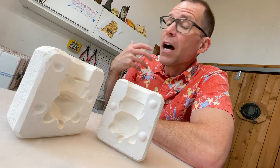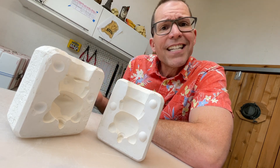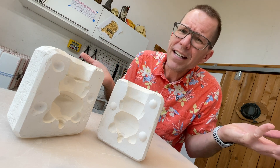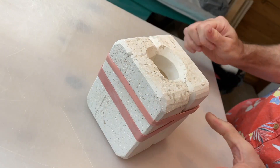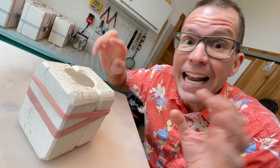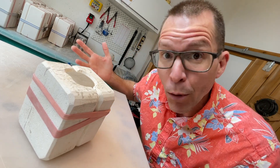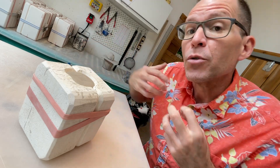You've got the river thing — the clay particles getting pulled down by gravity. But if you've really been following along, you're thinking: gravity doesn't work anymore because of the magical defloculant we used. All of our clay particles are negatively charged and hanging out in suspension. So how do I call it a sedimentary process? It's very simple. We've got the slip inside the mold, and this is when the magical dance of the two critical components of slip casting happens — the slip and the plaster of the mold. Plaster is porous; it is mostly air.